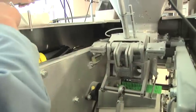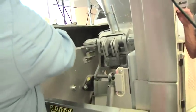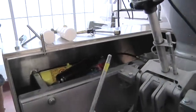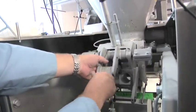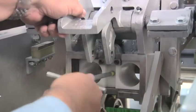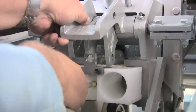The nut can be removed, then there's another tool in here — just a threaded tool which is used to pull the liner out. There are threads inside; thread the tool in and make sure you go in quite a ways. Don't just go in a couple of threads or you might pull the insert out.